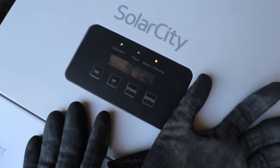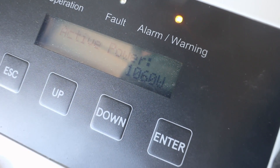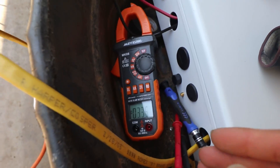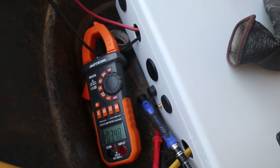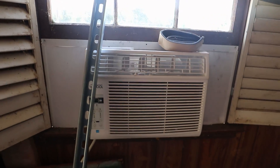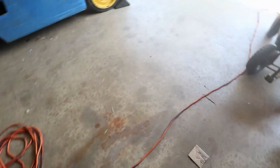Two and a half kilowatts — let's see what that does. We are pulling 1060 watts off of this array! On the amp meter we've got 3.4 amps — there's probably about 8 amps available. And look at this — we have cold air coming out of this compressor! The compressor started. Here's the cord running to the extension cord, running into the inverter.